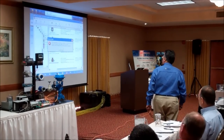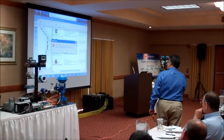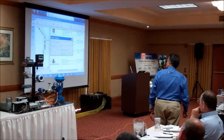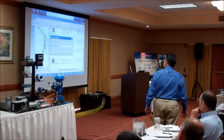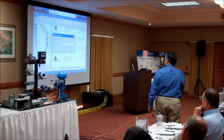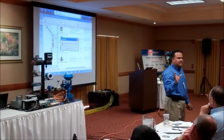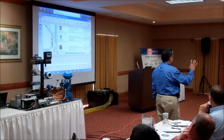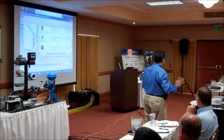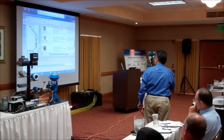So now what I am doing is changing the device from its temporary address to a permanent one. Foundation Fieldbus has assigned a specific set of addresses as temporary addresses — meaning the devices are parked here, ready to be assigned to a permanent position, but waiting for somebody to do that task. And that's exactly what we are doing. We are just changing the device information, and now the device will come back as a new commissioned device over there.